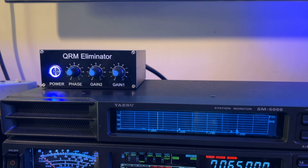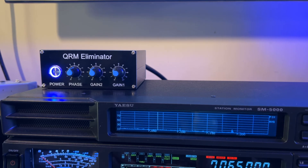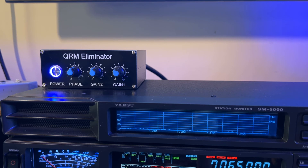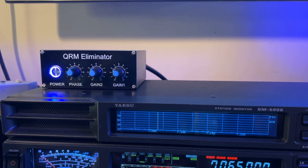I just wanted you to see that so you would know why it's important to connect a PTT connection to these devices. Now if you have an FTDX10, let me address that: you don't have that TX ground RCA jack on the back of that radio. You have a linear port which is a 10-pin mini DIN, and you have a tuner port which is an 8-pin mini DIN.